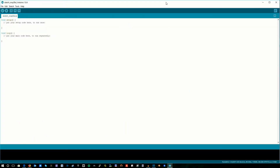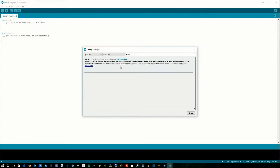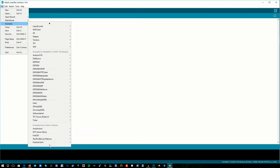As a quick start to use this LED strip with the NodeMCU, you need to burn new firmware using the Arduino IDE. First, open the IDE, navigate to Sketch → Include Library → Manage Libraries, and search for FastLED. Install the library. Then go to File → Examples → FastLED and select an example such as ColorPalette.